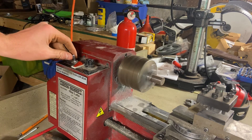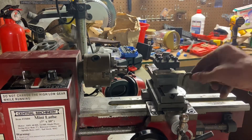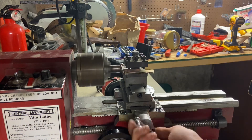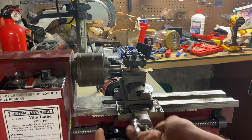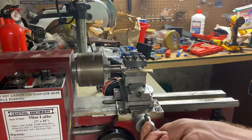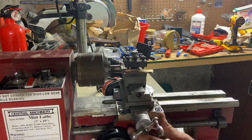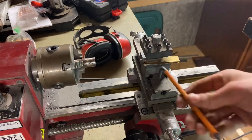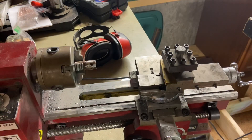Now since everything's been going so smoothly, it's time to spin a piece of metal at 1500 RPM — that could only go well. Actually I got the tool set up and took the first pass and honestly it seemed to work great. I didn't make this tool and I don't really recognize the cutting geometry — sort of looks like a small U shape — but it seemed to make a pretty good quality cut in mystery steel.